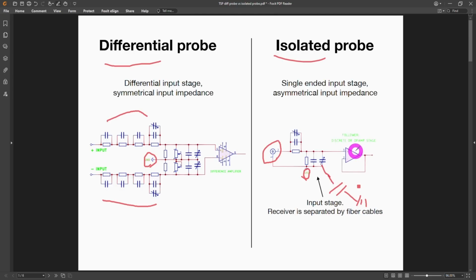And that's a really important, unique feature of something that is isolated, especially in this single-ended architecture that you see. You obviously have to be very careful, because you could float these things to a certain point where they can arc to the ground or the table you have them on, and that's again part of the reason why you have to use the tripod. But up to tens of thousands of volts, even in fast changing common mode signals, you cannot beat this in terms of architecture. Just generally, of course, the optical interface will have some disadvantages over this one, which we will show in measurements, but there's a very big difference in what you can do between these two architectures.